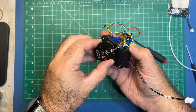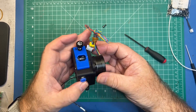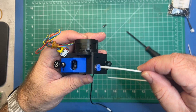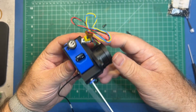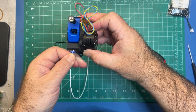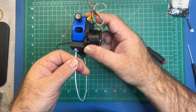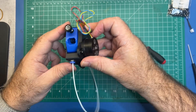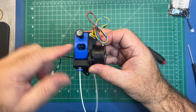There's a little bit of room to move and this is where the backlash is. It's a similar idea to what we just did with the filament. Insert your filament and with no tension it should move very freely, but when you start to push it up you won't have anything. The goal is to get it somewhere in the middle so you still have good tension and good movement.